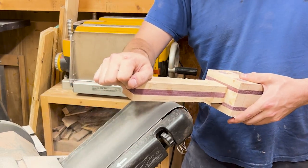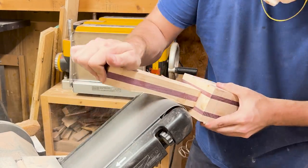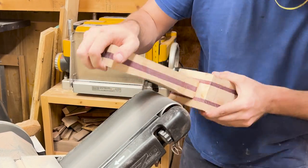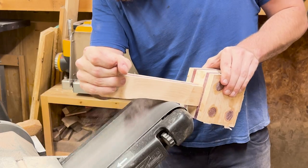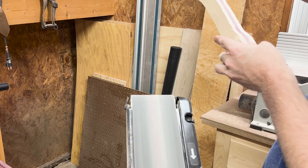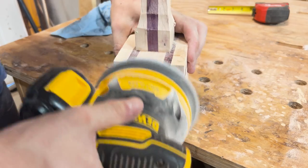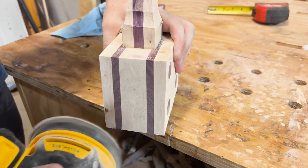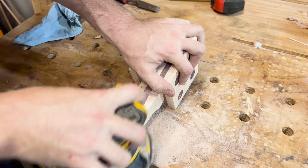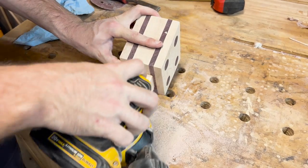Speaking of being artistic, I was now ready to finish shaping the handle on the head of my mallet. Normally other mallets have a smaller and narrower handle to just route over and sand, but I wanted to shape mine and give the bottom more of an axe-like flared knob at the end. This method also lets me shape it perfectly to my hand size and make it a little more custom. I went over to my belt sander and started at 60 grit, roughed in some pencil marks with a general outline, and I'm pretty detail-oriented so I like to rough shape and carve things rather than just use a template.